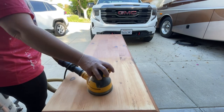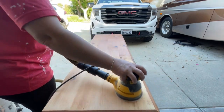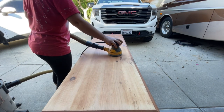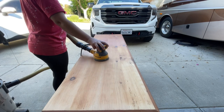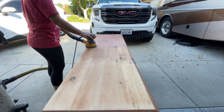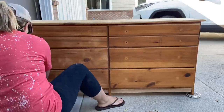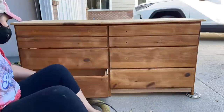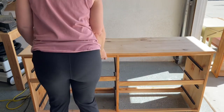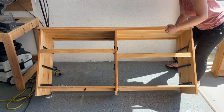Okay, here we are prepping — let's talk about what the plan is for this piece. I sanded down the top with my DeWalt orbital sander at 220 grit, just trying to get a smooth finish and take away a lot of the orange. I also gave the front of the drawers a scuff sand to prepare them for paint. What I want to do is a white color all around the piece and a paint wash on top to make it look like a faux wood grain.